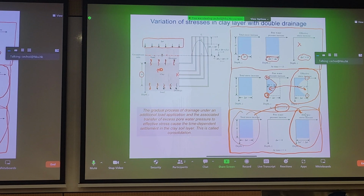So this is what's happening for a clay layer. Now, let's look at these piezometers. Each one of these is a piezometer. The piezometer enables us to look at the change in head or pore pressure locally at a particular point. So we have 1, 2, 3, 4, 5 points, right? Initially, at time equals 0, just after we apply the load, we have a uniform increase in pore pressure with depth, just like we do here. So it's uniform. After undrained loading, we see that there's a change in the head, and these two here are near the boundaries. That's why the pore pressure is the lowest.